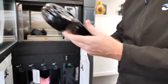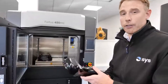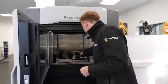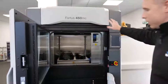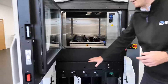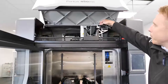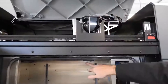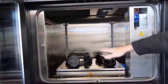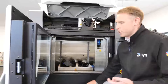If you only require 10 or 15 of those parts, why commit to a big expensive mold tool with a high piece part cost when you can actually print the part and have it finished? Simple, straightforward ease of use on this machine — you plug in your canisters of model and support material, the material is fed through the filament tubes all the way through to the two tips, and extruded onto the build tray. We've got the benefit of soluble support or breakaway support on certain materials.